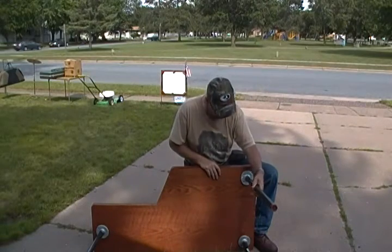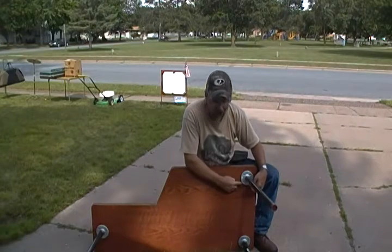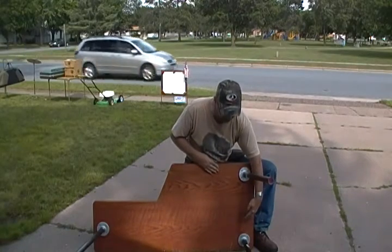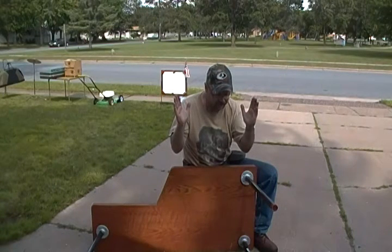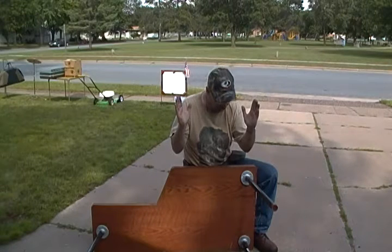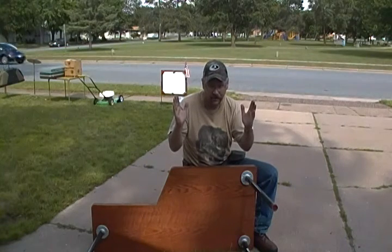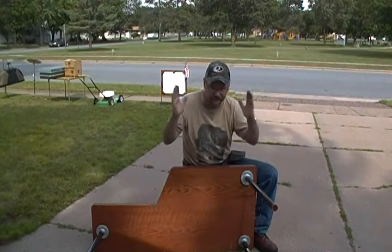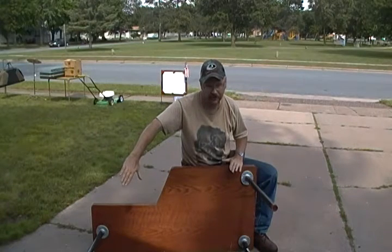Down here, underneath this flange, I've got 3 washers that measure 3/16 of an inch on each flange in the front, and what that does is spread out your legs and give you more stability. Right now, from being flat at 90, they stick out 6.5 degrees on each one, so I'm getting a 13 degree spread on the legs for front stability. And I tipped it also about 6.5 degrees on the back leg.